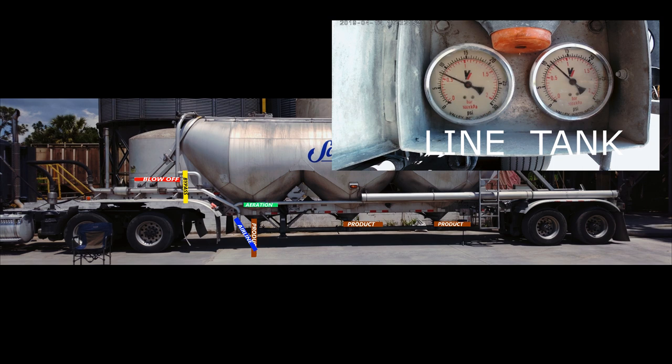The product is still flowing good, still in between 10 and 12 PSI on the tank side. I could have raised up a bit on my airline valve to slowly bring tank pressure back up, and then tapped it down a bit once the tank gauge reached 12 PSI.